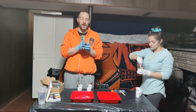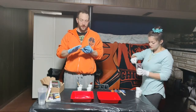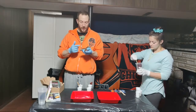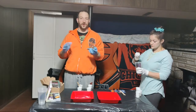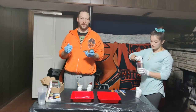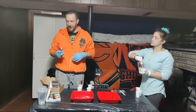But I would prefer to make it just a little bit thicker than it needs to be, because that way you can do a little bit of sanding and some work to it. Once you've sanded it, it will look like crap. But as soon as you put another real thin layer of epoxy on, the epoxy fills in all those little gaps and holes, and makes it look beautiful again.